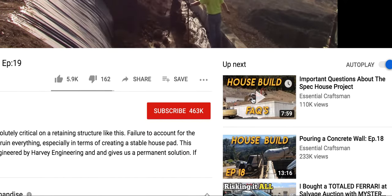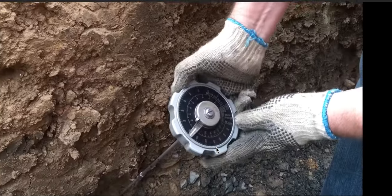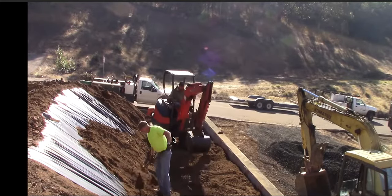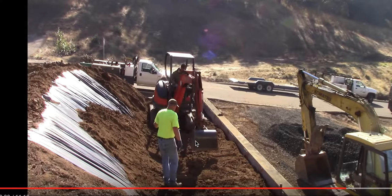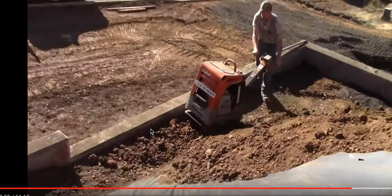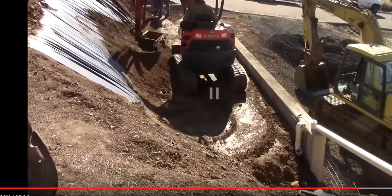He's going to build a house up here somewhere with a 10-foot setback. His geotechnical engineer Carl Broda has informed him he will not be comfortable placing any structure closer than 10 feet horizontally to this wall. So he thinks that the rock magically just goes straight down — that there are no lateral loads being applied. But loads go sideways about 45 degrees. This guy thinks loads only go straight down in the earth, that they somehow don't go sideways too.